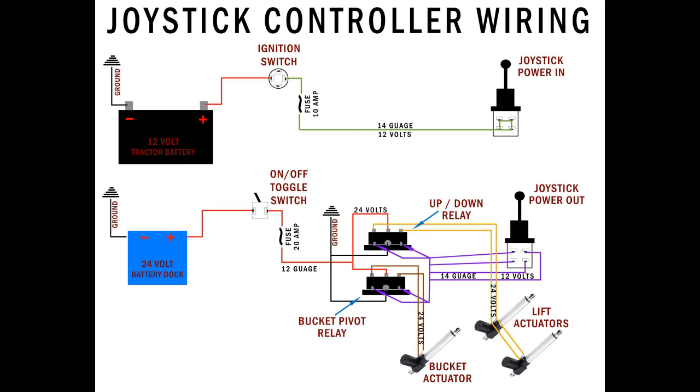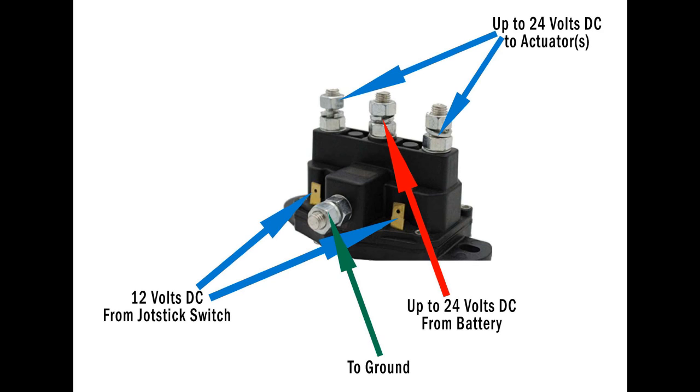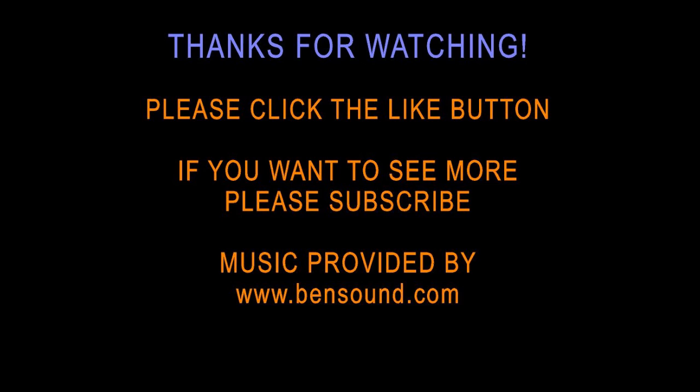It does a beautiful job. The purple wiring — you can use any color wire you want. I just did this to show that you've got some choices to make, because depending on how you want that joystick to work determines what terminal goes where. You might do some experimenting — just switch the wiring to the terminals around and you'll get it. The solenoid: you can see how they're to be used. There's 12 volts going to those small terminals on the front. The main terminal on the front is to ground. The top terminals are 24 volts or less and go to the actuators, and the center terminal provides the power from the battery. Hopefully this is helpful to you if you want to do some of this yourself for your own tractor. We hope you'll click the like button, and if you want to see more, please subscribe.